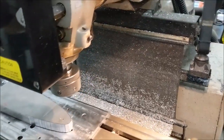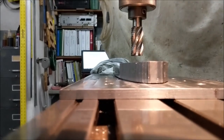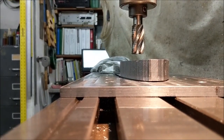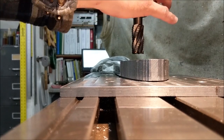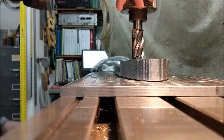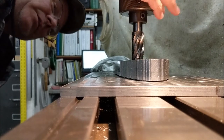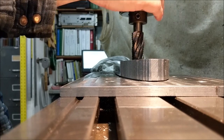I've put the tool in and now I'm going to do a quick touch-off. I just want to show you a way I do the touch-off — it's quick and dirty. You machinists are probably going to cringe — I'm a 'fake machinist,' but what I'm doing is I'm just using the knee mill hand crank.